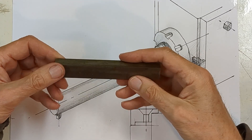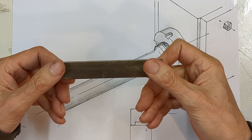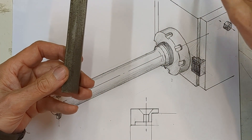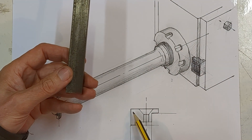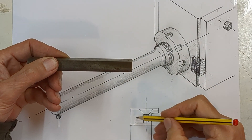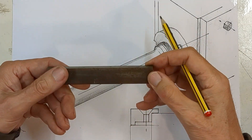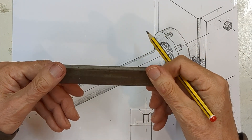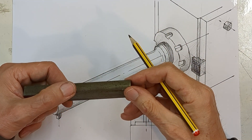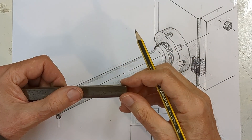For the material I have this half inch by three quarter mild steel stock. It will come nicely out of that — in fact, this three-quarters of an inch is that dimension there, so that doesn't need to be changed. But the half inch will have to be machined down to the correct depth because space is at a premium. I'll get both clamps out of this, make them as a pair, then cut them off and face them to make two clamps from one piece of stock.